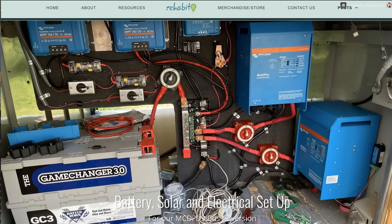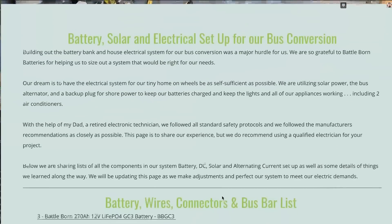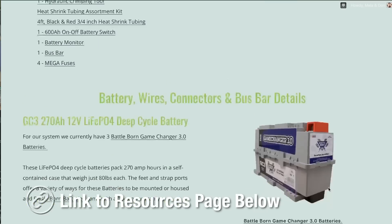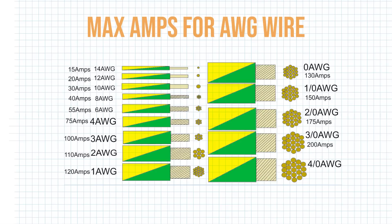It's important to note that wiring up all these components together can get a little tricky. We've got a complete blog post — link in the description below — where we detail each and every wire, fuse, and on/off switch that we used. When wiring up your system it's important to know how much amperage is going through those wires so you can plan ahead using a wiring chart and select the correct wire capable of handling that much power.